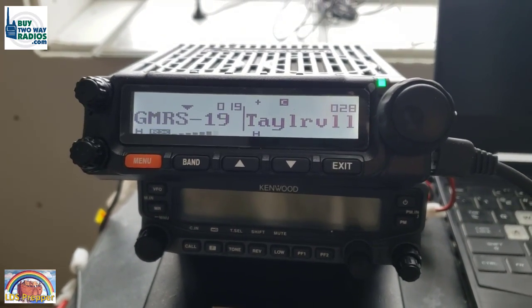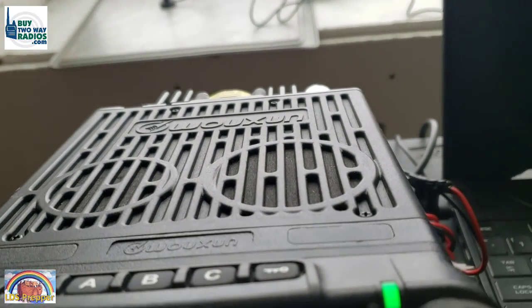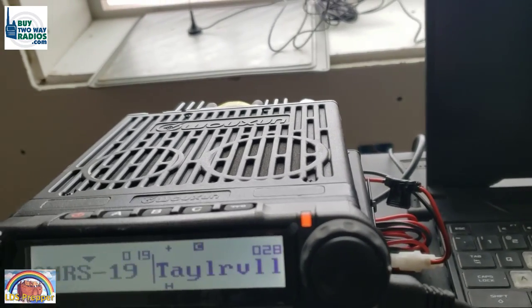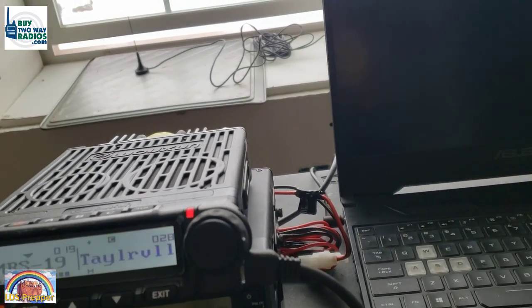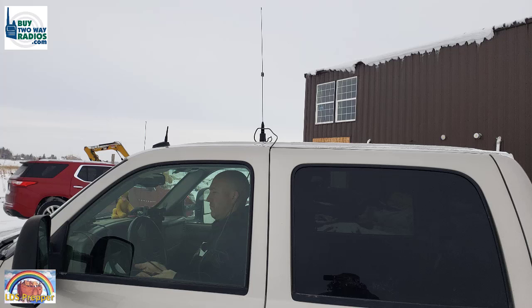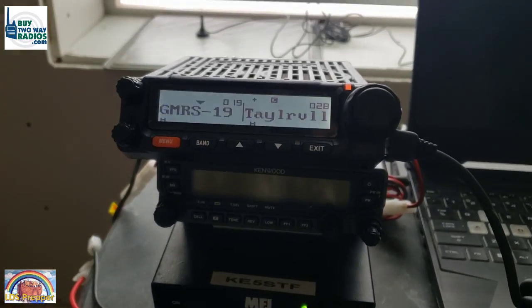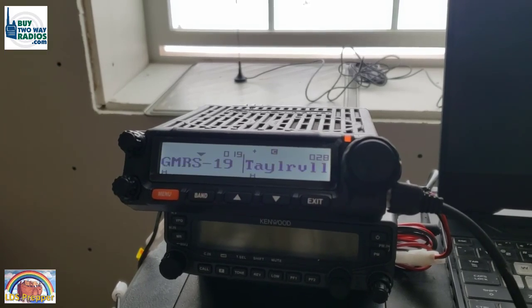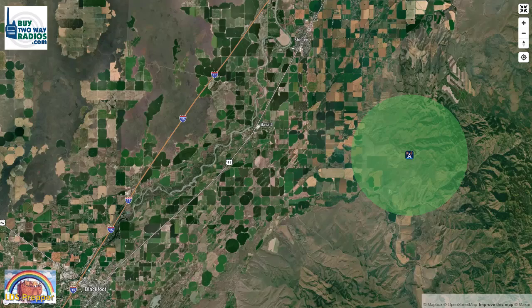Signal is getting really sketchy. [Brian] Hey David, I don't know if you can hear me. I heard you broadcasting — I've got static on my end. [David] Understood. I hear you at mile marker 73. The situation here is probably the antenna — we're really stretching the distance that GMRS can go. He's not able to hit the Taylorsville repeater because it's basically due east of me. The further he drives south, the further away he gets from that repeater.